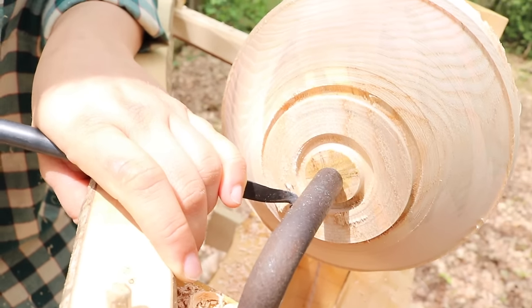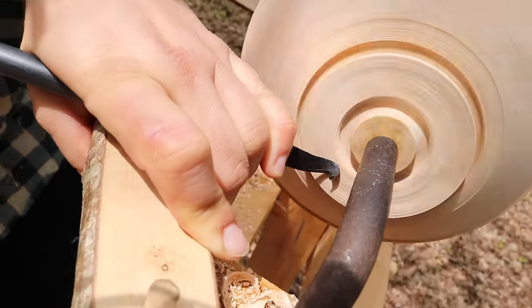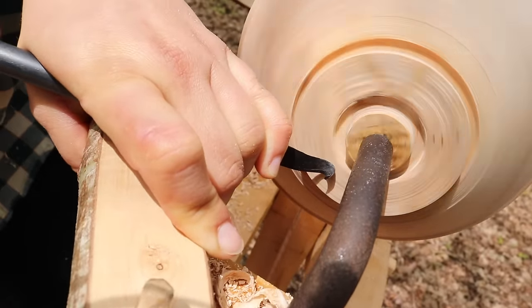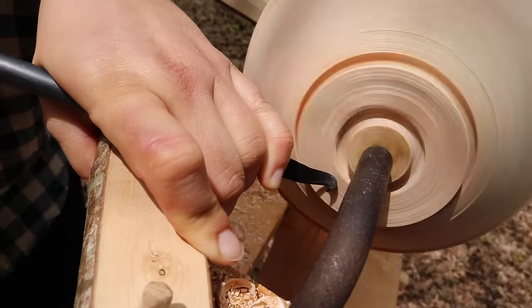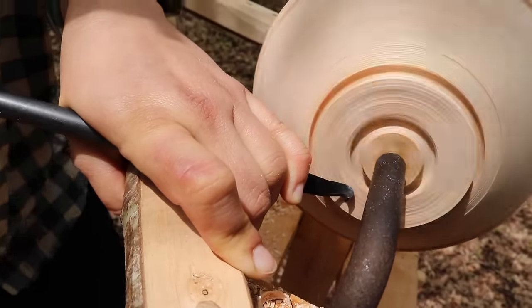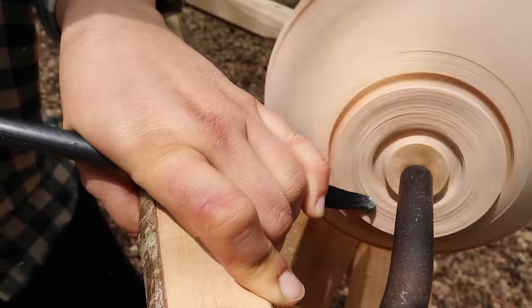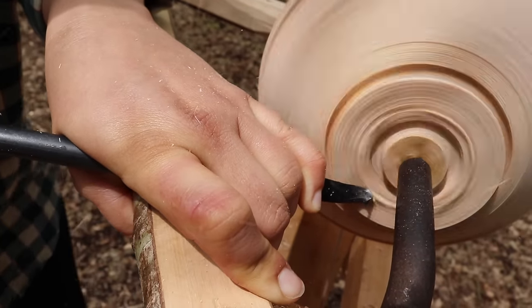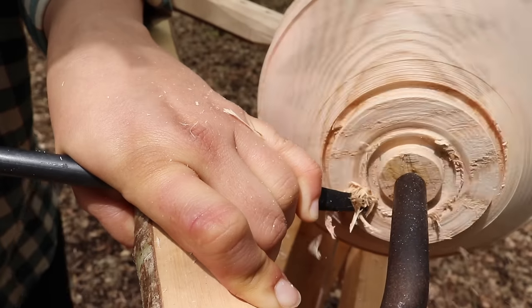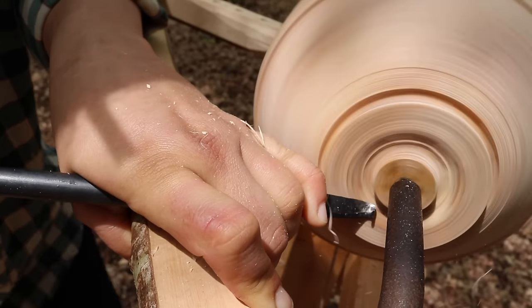And if I angle the cutting edge slightly away, start turning, okay? This is just to figure out what angle you need the tool in order to be cutting. So I turn it away and I start pedaling and then I'm slightly rotating in. Oh, now it's cutting. So now I just stay there, and then I push against that shoulder that I've made, down to that low point.